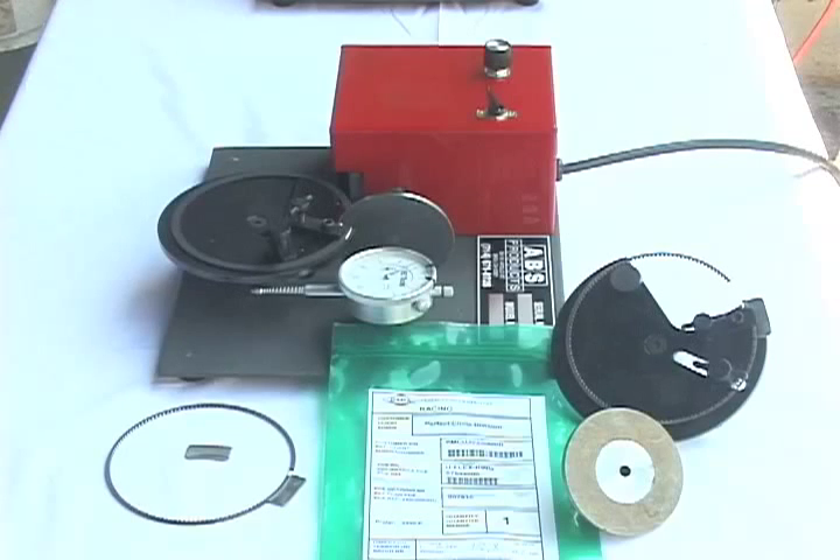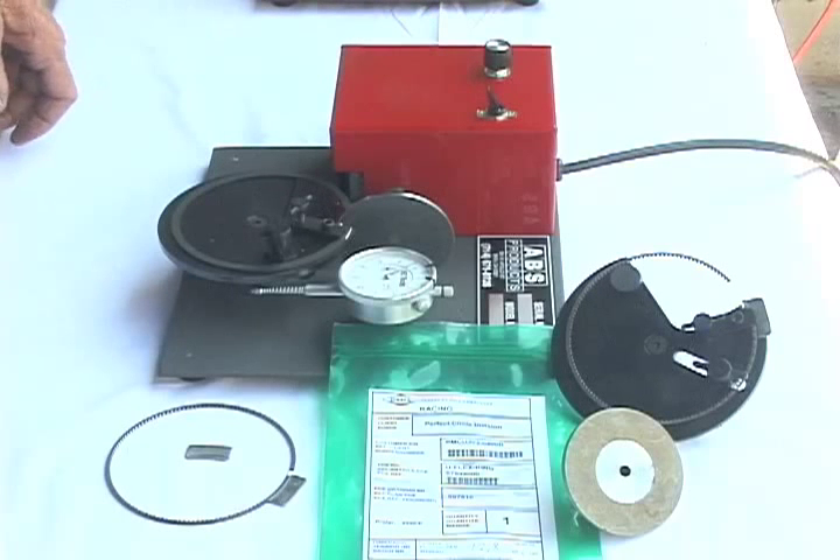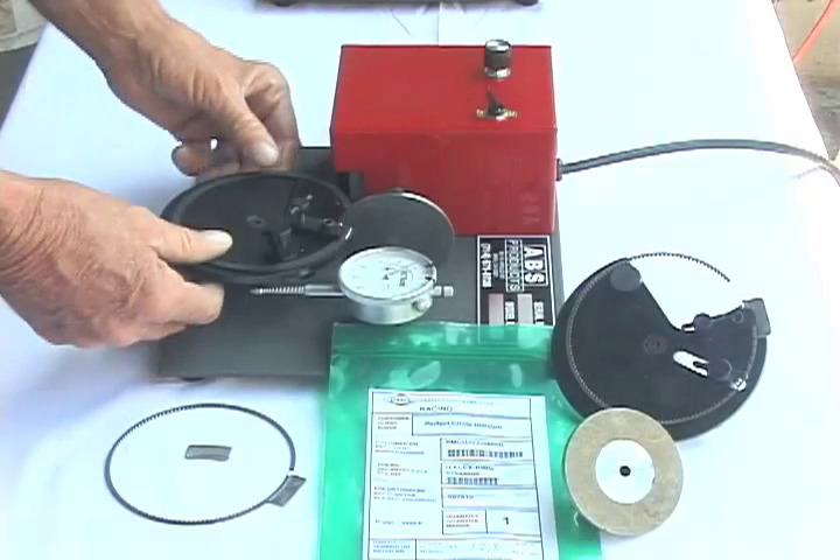Here's our new 5950 — it's got the larger DC motor, that's why it's got a bigger cabinet, and it goes from zero to five thousand RPM. The reason why I had that made is because we get the same amount of power down at low RPM, so you've got full power at two thousand, the same as what you do at five thousand.